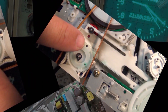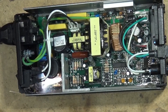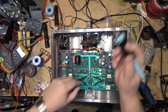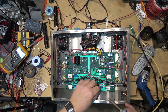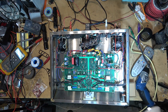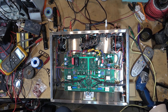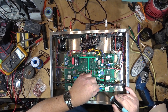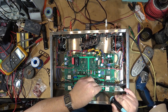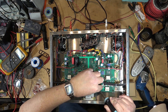While doing some testing I found that some of the voltages looked a little bit out of spec from one channel to the other, so we're going to do some investigating. From the prior video, the one red cap on the right side was the one that shorted and took out the left channel. After discussion with the owner, it was decided we're going to change the other caps as well, just for good measure.